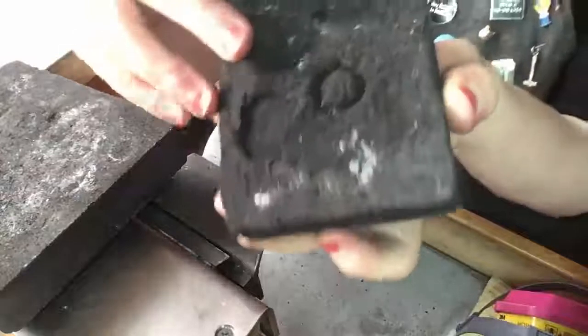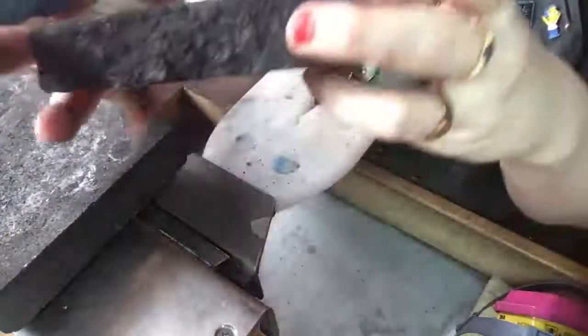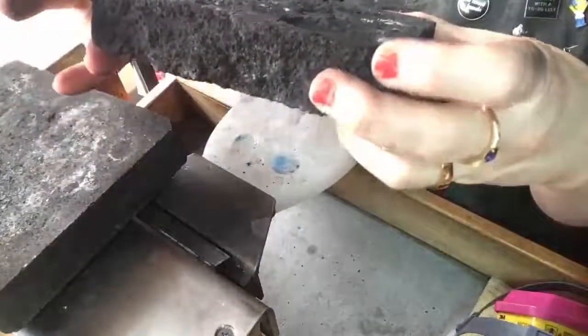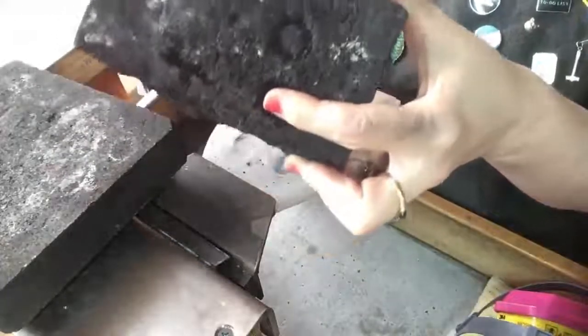My compressed charcoal is so awesome — look at that! Now we have a nice smooth ingot mold. It's going to reduce the amount of oxygen and prevent fire scale, and that's going to be a really great way to melt down small pieces of scrap at your bench.